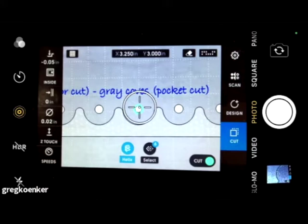So you can do that when you're programming. I'll be perfectly honest, I don't most of the time. I just draw the outline of what I'm doing, and then I change whether it's inside or outside on the tool. It's easy enough to do. And to be perfectly honest, it's messed me up a couple of times because it defaulted to, let's say, an exterior cut, and I said, okay, I'm ready to make this cut. I didn't realize it was doing it as an exterior, and I wanted it to do an interior. So you can get messed up by that. It's kind of nice if you're making the drawing anyway to make the fill and the stroke the proper color to do what you want to do. You'll save yourself some headaches, but don't always do what I do. I guess do what I preach, don't do what I do.